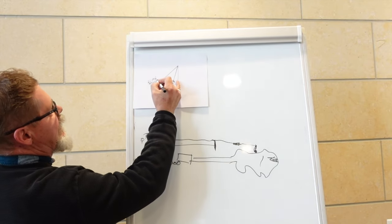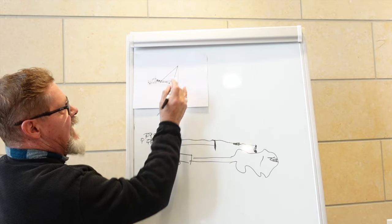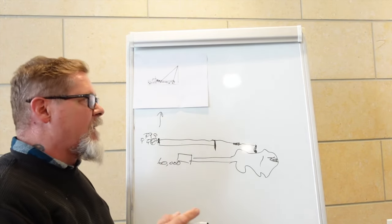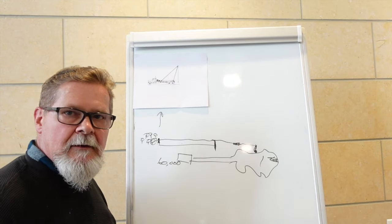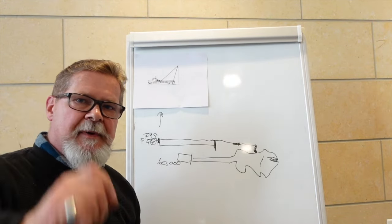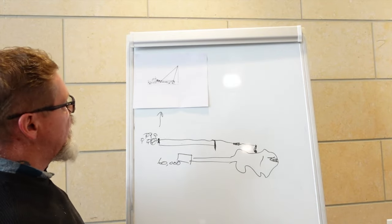When these things break off the headache rack or lay down onto the headache rack, if this is attached to here, there is a huge amount of pressure on this block. And if that block fails or the winch line fails, it will come through the back window of the rig-up truck, and it is deadly. You've got a pulley this big or winch line this big coming at you like a snake, kind of like a rubber band, whew! And people have been killed that way.